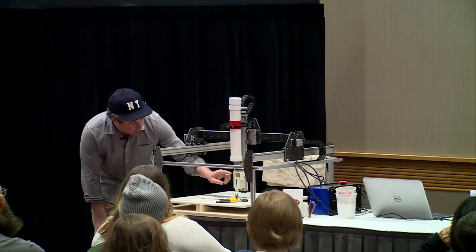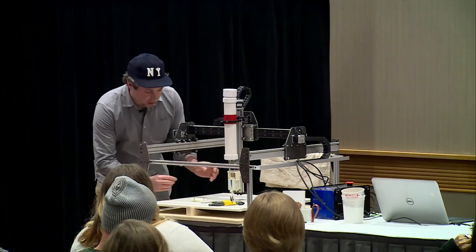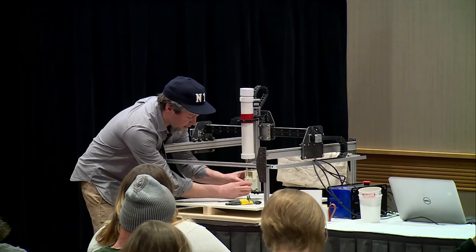There's a print apparatus here. This motor turns and it squeezes a little rubber tube, and when the motor does one full revolution, it puts one little droplet of slip out. I'll assemble this pump — I had it apart so you could see the inside. I'll try to show you the workflow from Rhino as well as a little about the machine.